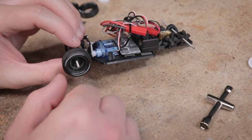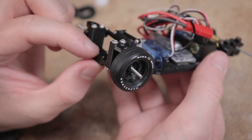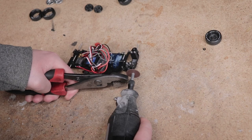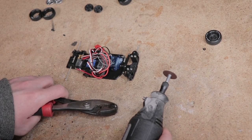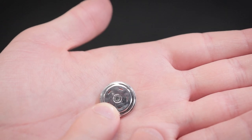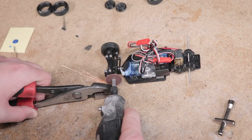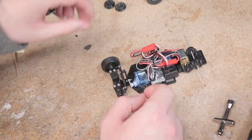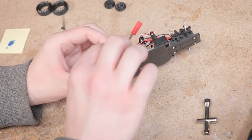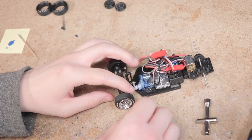You can see the wheel nut in there which holds the new printed piece, and there's still plenty of room for that chrome wheel insert piece. Now I need to cut down the axle shafts so they are just long enough for the nut to thread onto, but not so long that they prevent installing the wheel insert pieces. Fortunately these pieces have a large enough hole in the back for the axle shaft to slide into, which confirms this conversion was meant to be. I measured where I wanted to make each cut and removed the excess axle shaft with a rotary tool. To make sure the wheels don't go flying off I used some Loctite — hopefully just a little on the end is enough to keep them from coming loose without making them too difficult to remove.